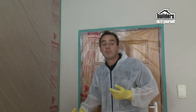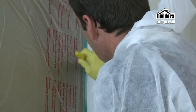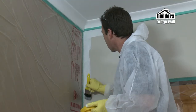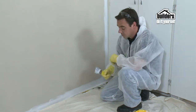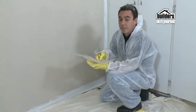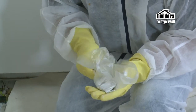An important step before you start painting a wall is cutting in. This is basically painting the areas where you can't reach with a roller — for example, where two walls join or on the edges of doors. Continue cutting in for the rest of the room. Once you've finished cutting in, you can either wash your brush out or wrap it in plastic or cling film so it's ready to use again a bit later on.